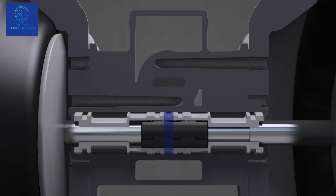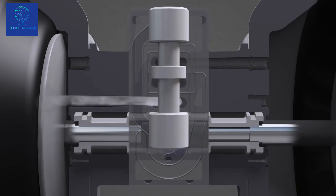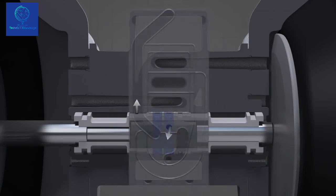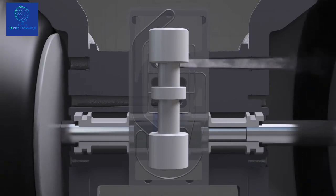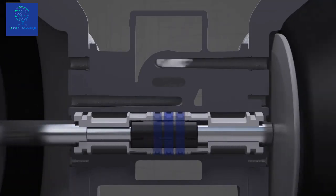When the pilot air valve travels far enough to the right, chambers 3 and 4 are connected. This allows the pressurized air from chamber 3 to pass through and exit chamber 4, which moves the main air valve upward. This causes the left diaphragm to pressurize and the pilot valve to begin moving left. When the pilot air valve travels far enough to the left, chamber 3 connects to chamber 2 and the air moves the main air valve downward. This causes the right diaphragm to pressurize and the pilot valve to begin moving right. Throughout the cycle, one side pressurizes as the other exhausts. This process constantly alternates between the pilot and main air valve to create a continuous cycle.